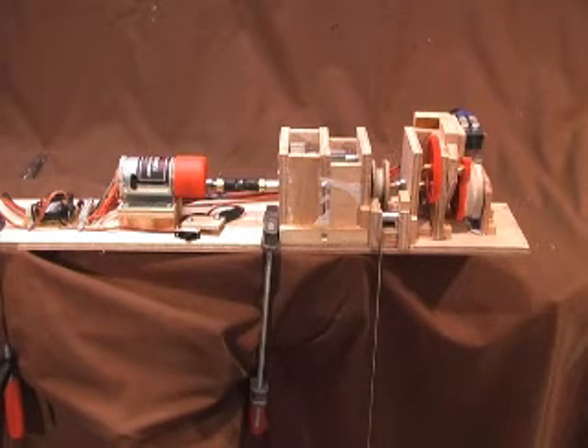This ratio of 300-to-1 is really the limit we can go with on this design. If we let it out, it runs on after the joystick has been centred — power on, power off. So the next design is going to have to be a different type of gearbox.